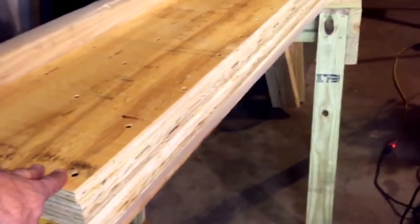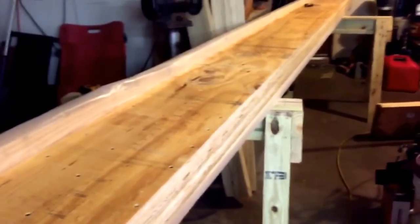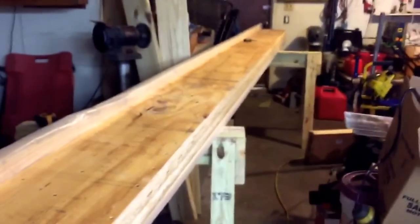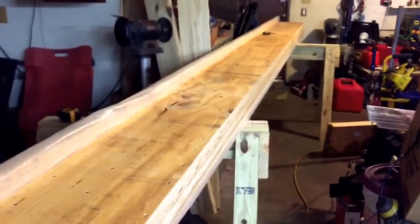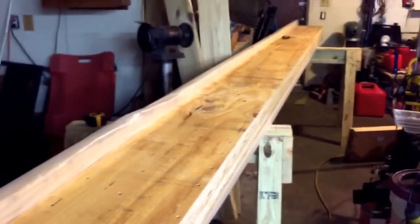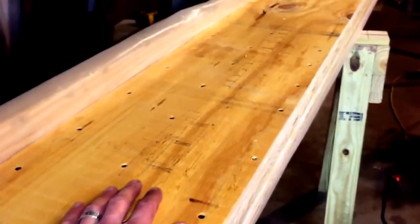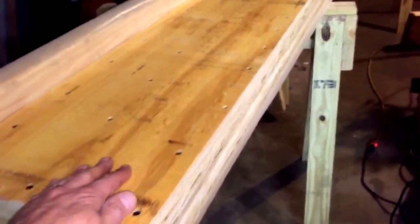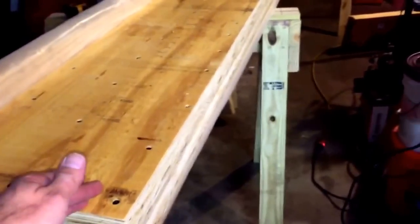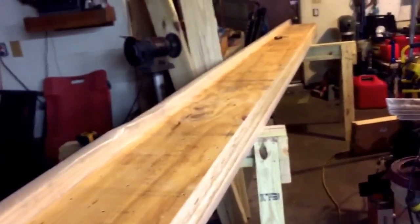In our application, the room we're working on has a hip roof. The nature of a hip roof is that the primary loads are borne on the exterior walls — very few rafter jacks come down. Hip roofs are largely self-supported because of their geometry. So realistically, this beam is really only carrying the weight of the ceiling with minimal weight from the roof. This thing is going to be 30 plies thick, four and a half inches wide, 11 and a half inches tall — excessive for what we need. Since I didn't go to a civil engineer, I made it excessive. I am an engineer, just not a civil one.